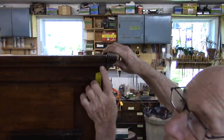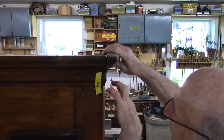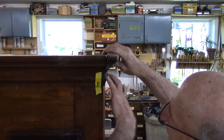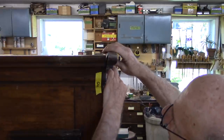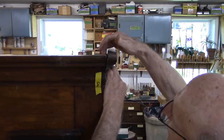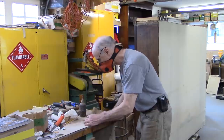This is fitting so much better now. It's still open here at the top, but I think that's as far as I can go. I'm going to glue and nail this in position so that it's flat against the cabinet, and then I'm going to add a wedge piece in the top here for support. That will also fill this gap.